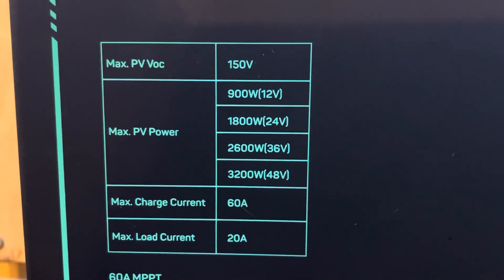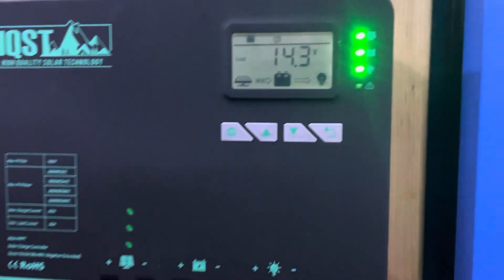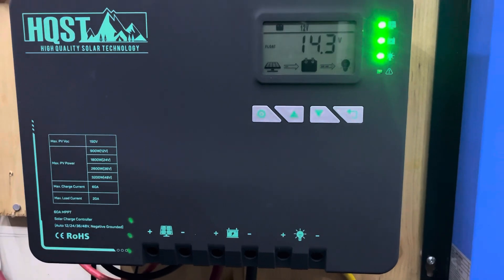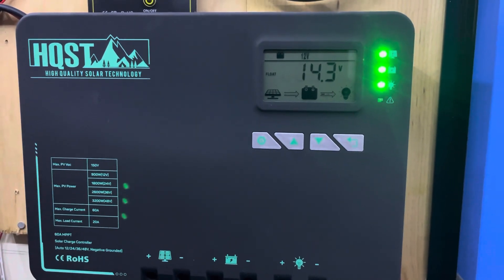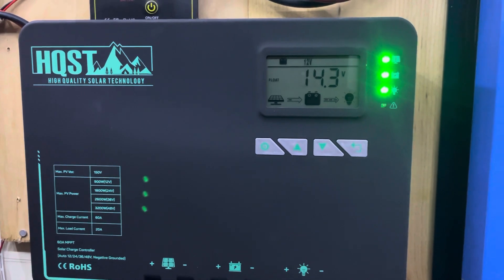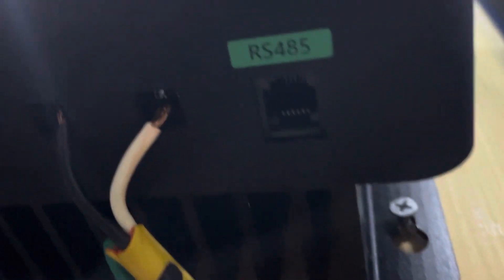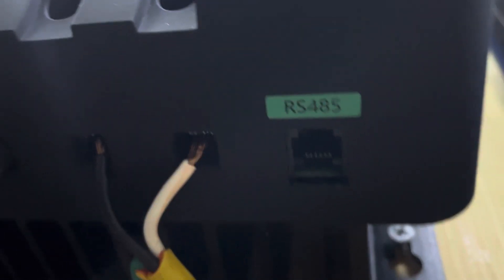Currently I have it on 12 volt. Another thing of note is that it has RS-485, and the great thing is you can actually parallel two of these devices together. You can do a 60 and a 40, or a 60 and a 20, whatever you have. If we look down at the bottom here — I don't actually have it set up, but there's the port. If you connect those together, the two devices will talk to each other.